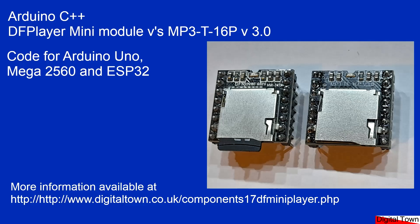The only thing I could see at first was the modules I'd been sent were not DF Player Minis but MP3-TF-16P Version 3s. I got the manual and both items seemed to be identical, so what was going on? The odd thing about my particular issue was that when I was swapping these units over it was on a pre-made board, so there were no changes to the wiring. The SD card was the same SD card, so it was a bit of a mystery at first as to why this didn't work. I started doing some work on a breadboard and suddenly I had the unit working.